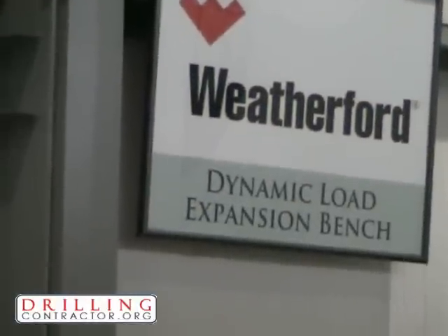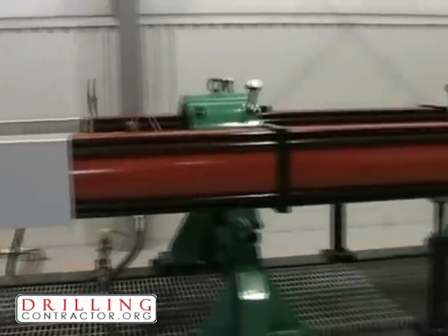Saudi Aramco, for a number of years, have been drilling laterals out of their existing wellbores in some old fields, using five and a half inch expandable casing as seven inch production liners. Early in their project, they experienced some failures in the deviated sections of the wellbores, always in the connection. We became involved later on, and one of the problems was there just wasn't any ability to accurately simulate the downhole condition in that deviated section. So together, we developed an apparatus for testing here in our lab, ran some tests, and developed that information into this technical paper presented last month in Bahrain.